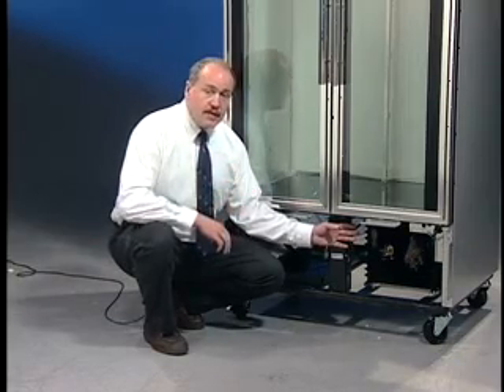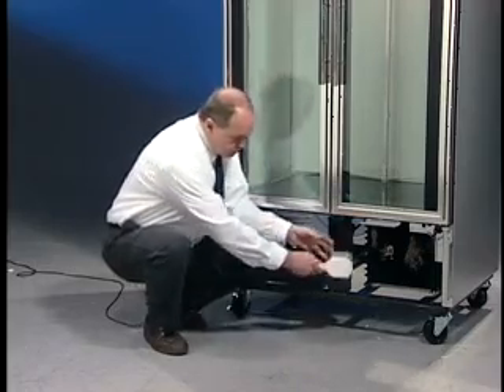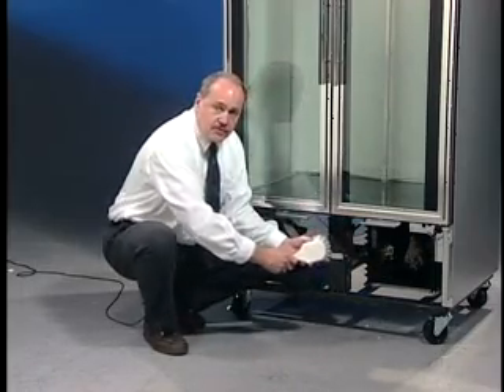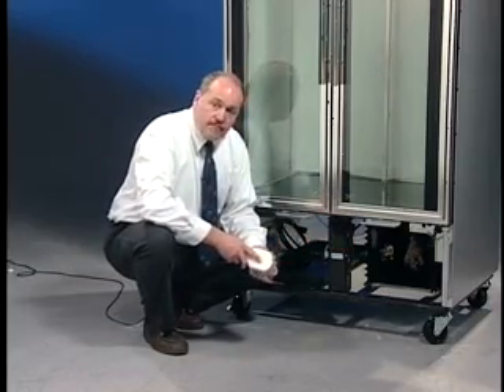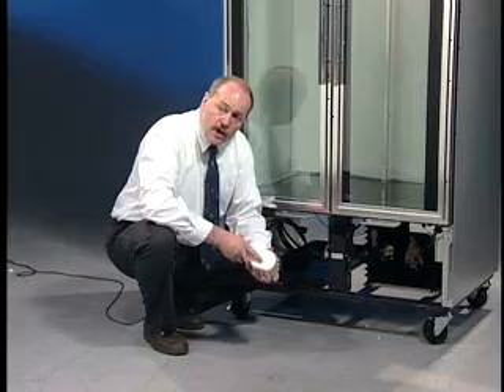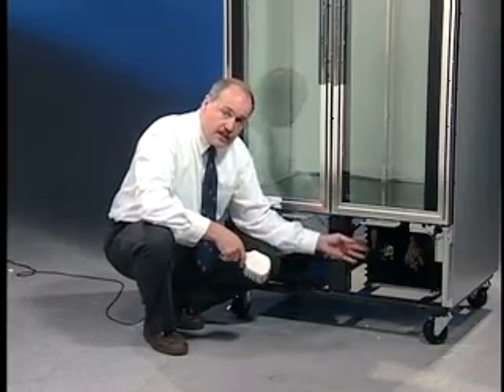It's very important to make sure that the condensing unit is cleaned, and that you can see through the condenser — that's how you can tell if it is properly clean. You might need a heavy duty nylon wire brush to brush off the dirt, or if you don't have a heavy duty brush, you can use a shop vac to suck all that off. In the food service industry, you're actually going to need to get in here and use both.